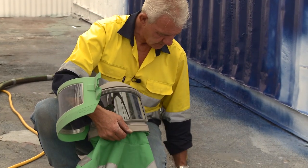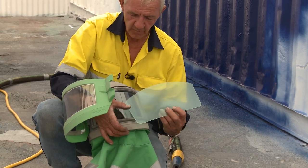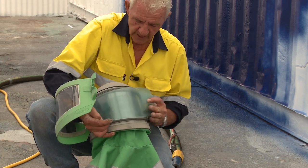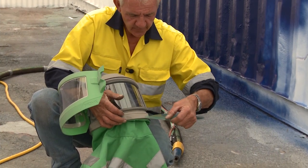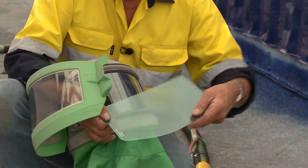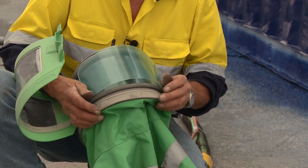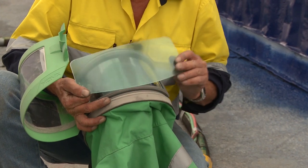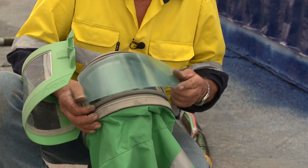So an inner lens — like so — and there's the protective film on the inner lens. You can see the lens only fits one way; it doesn't matter inside or outside, but it does have a number here. That number means this particular lens coincides with the standard — the standard is for accidental ricochet or something that may rebound when you're blasting, to ensure that it cannot penetrate the inner and outer lens and hit you in the face or eye. So it's designed to do a specific job.